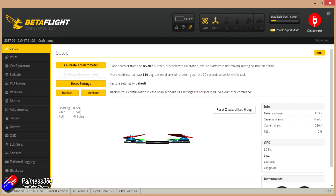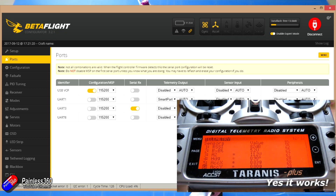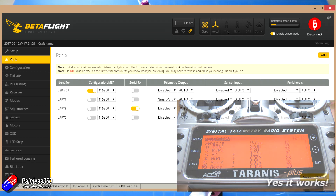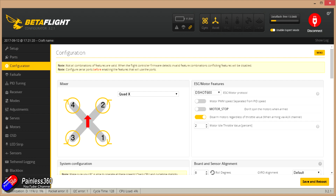You can go and have a look and see what they were doing with your model before you got it. It is definitely an indication that the system has been powered and armed. The port setup is very nice. Smart port is enabled on UART1, so that probably means we can get our telemetry back to the radio. And also on UART6 you can see that it's set for IRC Tramp. Because the Holybro Atlatl FPV transmitter talks IRC, it does mean that we can change the bands, frequency, power and all that goodness inside the on-screen display in Betaflight.